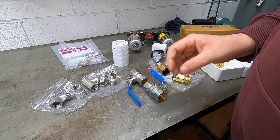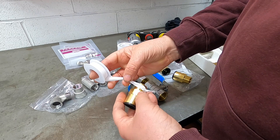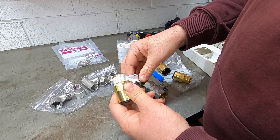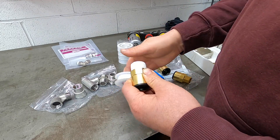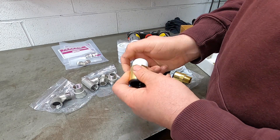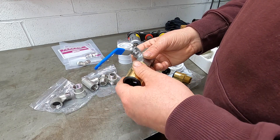So we'll get putting it all together and get it all fitted. We'll start with these - put these onto the valves, the two valves. If you've never done pipework before, obviously the thread goes this way around, so you want your tape to go in the same direction. Once you get it lapped over itself it's quite good, it holds. So we're just going to put quite a few turns on, pull it tight. We don't want any to go in there, so I'm not putting any glues or sealants on - I'm just going to use the PTFE, because I've never put any other stuff on before when I've done air pipes.